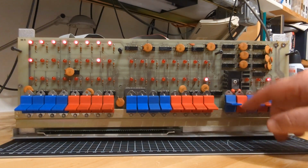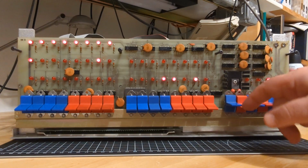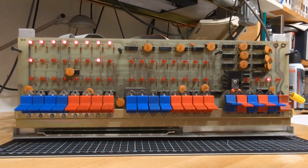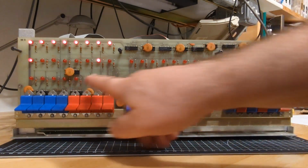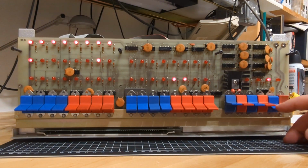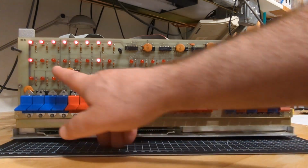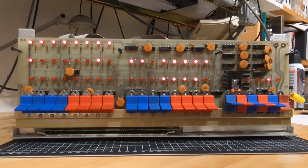Now let's go ahead and put a bunch of no-ops in the memory here for another clue, all right? These are just a bunch of no-ops, okay? Go back to here. I can even do a reset. I've got a zero on the address bus. If I single step, and we saw this like two videos ago, it does want to execute what's there. Now, I'm only executing no-ops here. I don't have my M1. M1 I've never seen turn on this thing, ever. But it does seem to be executing all those no-ops.